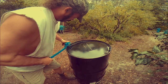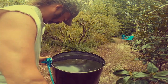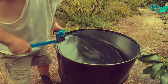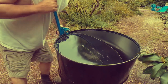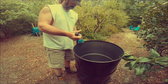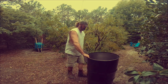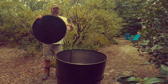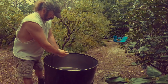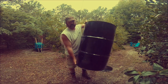It does work great — use these for everything. When you get to almost finished, you actually take it off and come in from the back side. Because once that edge bends down, you come from this side and cut it back. When you're going to finish the cut at the end, you just have to pound over about an inch, inch and a half of sharp edges. But basically, that's how you cut yourself a barrel.